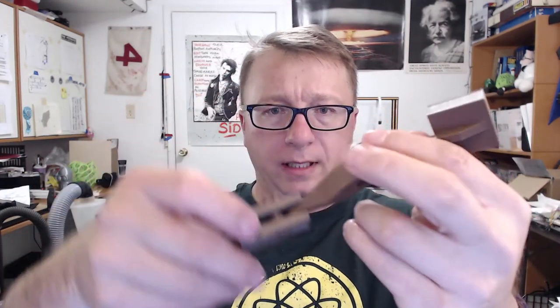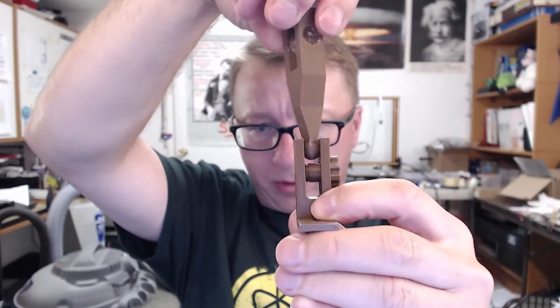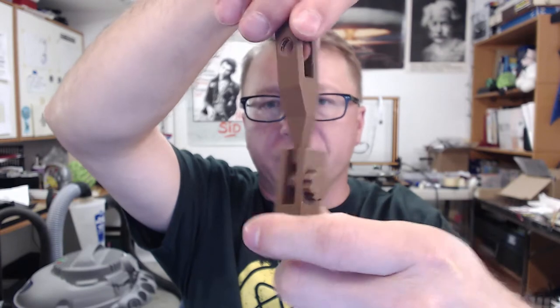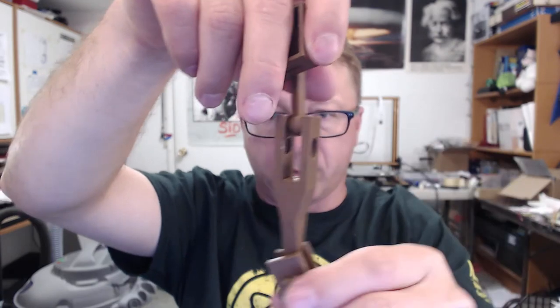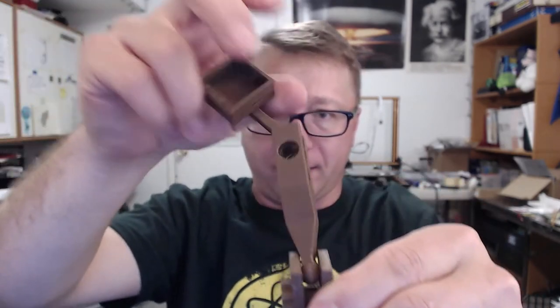Okay, so we're back. Here is the original design that I had. The camera here — the ball joint kind of flips around, and then there's another ball joint there. The theory is that this part seats into the T-slot, it just kind of turns, and then you can rotate it around at any angle necessary. There were screws and bolts that go in here and a bolt that goes obviously in here. It turns out no matter how much you tighten down this bolt, this thing still kind of moves around with very little pressure. So it didn't work very well at all.